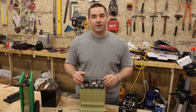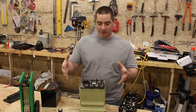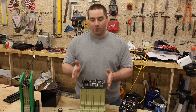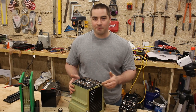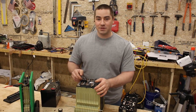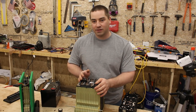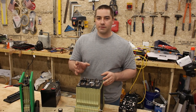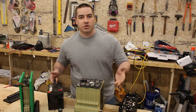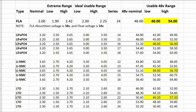While I had the 12S configuration of the lithium NMC chemistry — the Chevy Volt pack — had I to do it over again today, I would take the extra effort, break the pack apart, and create 14S. I think 14S for a lithium NMC chemistry is the ideal voltage range. The ideal voltage range is one that works with all the other components — the inverters and the charge controllers — and they're all based around the lead acid platform. So let me show you this spreadsheet I created. The top row shows the flooded lead acid: nominal voltage is 2 volts per cell, 24 cells in series, and we're typically going to be operating in the range of 48V to 54V.